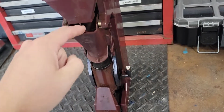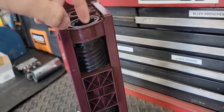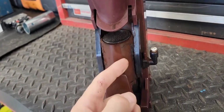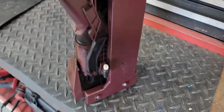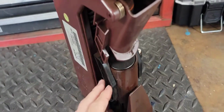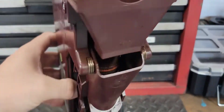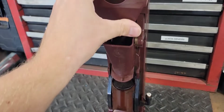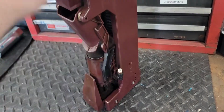Grounds come in here, go through the chute, land on top of this piston, and then the motor rotates this corkscrew, which in turn presses this piston up into that one, and that's what makes your puck. So having the machine clean, having this free of any debris or excess coffee grounds is key for this to work properly. It sits just about this high off of the base plate inside, and if you get a bunch of buildup underneath it, it causes a lot of issues. So it's key to make sure you have this wiped off with the brush inside the machine. Ideally daily, you want to hit this with the brush and clean any excess grounds off.